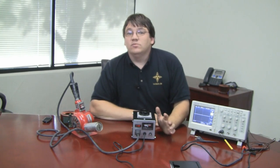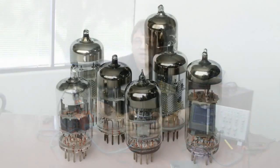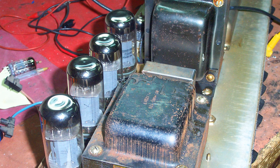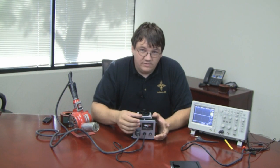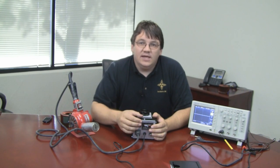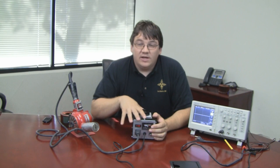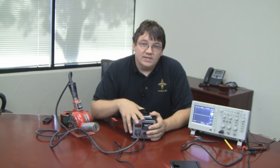Another place these are really popular is in tube-style amplifiers. With older-style amplifiers, you'll often want to gently bring the voltage up, or they were designed in a time when line voltages were lower. Providing a full 120 volts to older-style capacitors and components in antique amplifiers could be damaging to them. So a lot of people use variacs to bring the voltages down to an acceptable level for their antique amps.